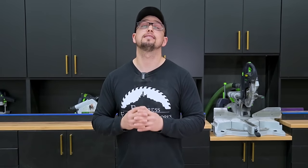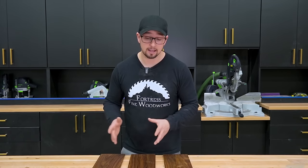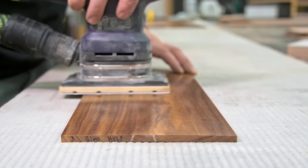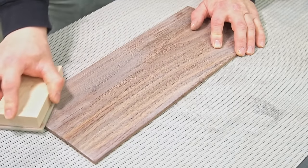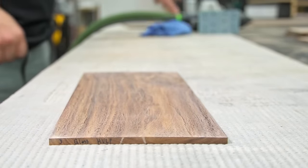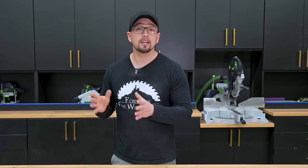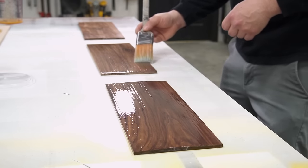The third and last coat is absolutely the most important because it sets the stage for the final look and feel. But before we do that, I want to test how it sands because there's a plethora of different problems that can arise when sanding finishes. I'm using 320 grit with an orbital to start, mainly because that's how I usually sand every other finish, although the directions do say to sand with the grain. To soften scratch marks, I'm using a fine grit soft pad at the end, sanding with the grain. I definitely like how all of these finishes are sanding — it powders up nicely and sands quickly, but not too quickly so that I don't get too much burn through. If they're telling you to sand with the grain, usually that means those scratch marks are going to translate through into your top coat. So let's see if those scratch marks end up translating through, even with softening them with that pad.